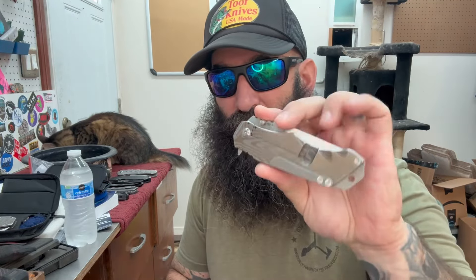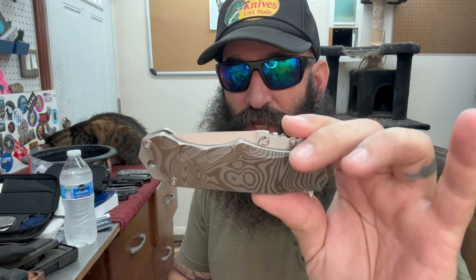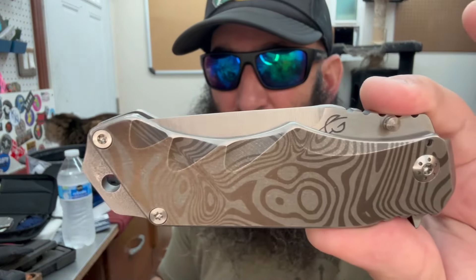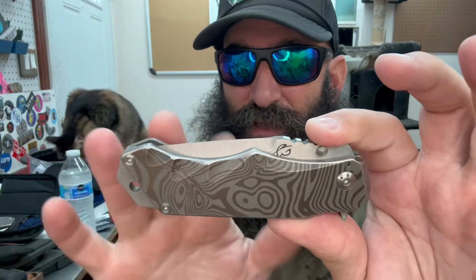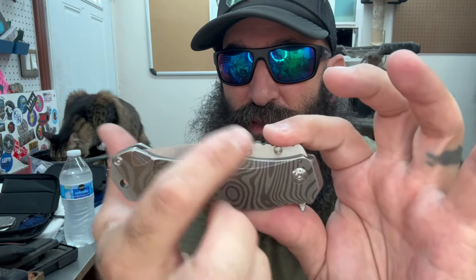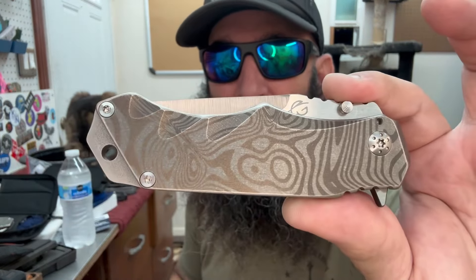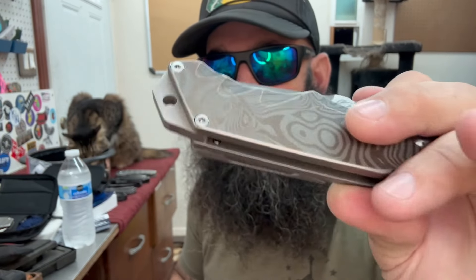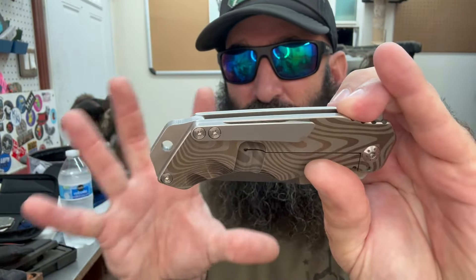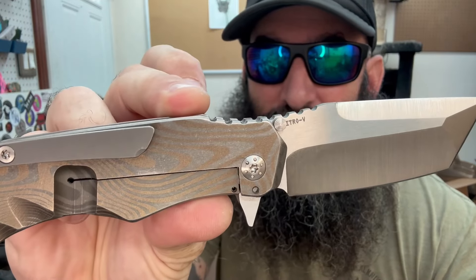This is a Scorpion Six — I'm not even sure of the model name. The customer asked for studs, a detent rework, and possibly taking off all the rounded edges. I'm going to try to get as close as I can — you can see the edges are similar to what I did on the 229s. I don't want to take away the style of the knife, so I go around in this direction and around this direction, just trying to smooth it out. For concealed carry folks that's usually called CC. I went through and did that, keeping as much of the original design as I could. I did thumb studs, and I got the pucker factor on the first one — look how close that stud came to hitting. I wanted it tucked in nice and tight.